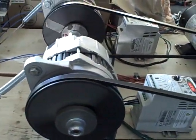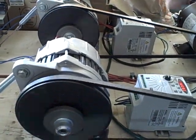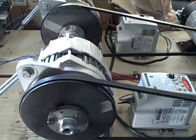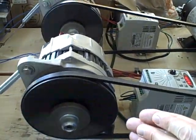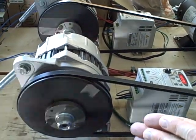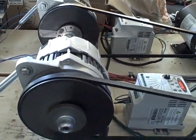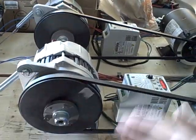The reason why this works is that these are multi-pole alternators — they're not two-pole machines. There are actually multiple positions on the rotation where these two sets of three-phase voltages could be in phase with each other. So I just happened to choose another place in the rotation of this generator shaft where in-phase operation is possible. If these were two-pole machines, there would only be one position on the shaft where it could sync up with that one position on the other shaft. But being that there are multiples of two poles, I have options available to me.